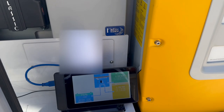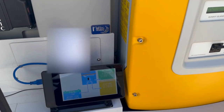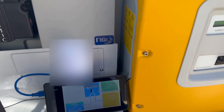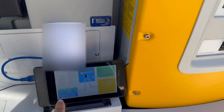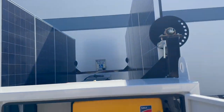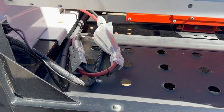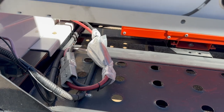It's connected wirelessly to my network and getting data from a SMA 7.7 solar inverter. But this reading is correct — I've put a Smart Shunt in the system and this is what's actually coming to the battery. It's quite low because the panels are not in the optimum direction to the sun. The Smart Shunt is temporarily in a bag to protect it from shorting and from the weather.